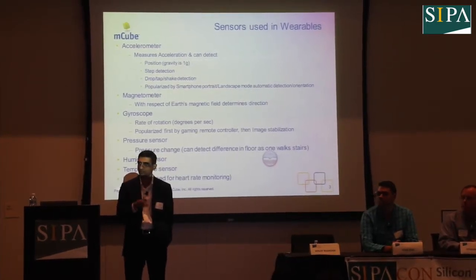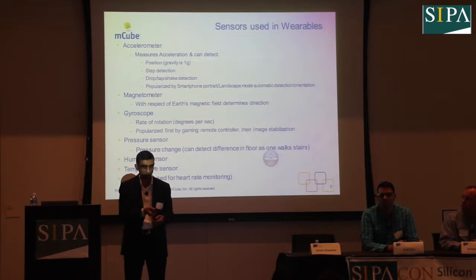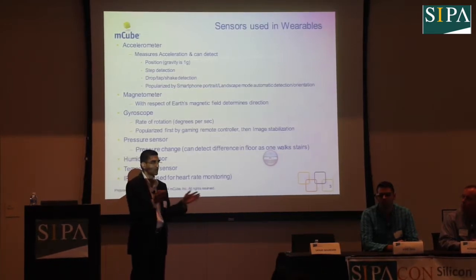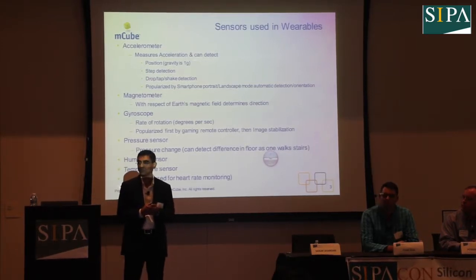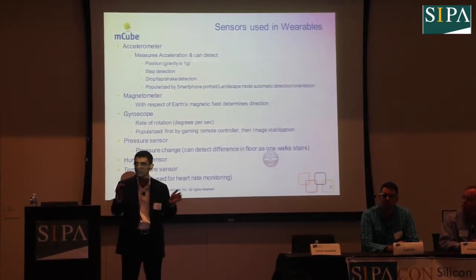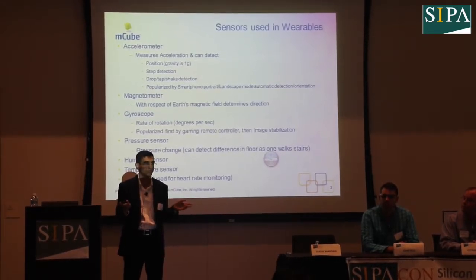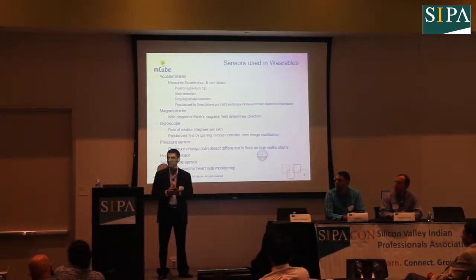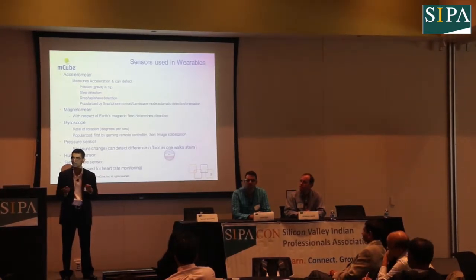And that together with the other sensors enables navigation. It's one step towards that. Together with the third sensor that goes in there, which is the gyroscope, now you get what we call the 9 degrees of freedom, which can essentially give your coordinates as you move along. So if you are in a closed space like this, there is no GPS here. But if I am moving in this room, on the basis of these 3 sensors, you can track exactly where you are.